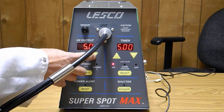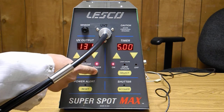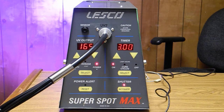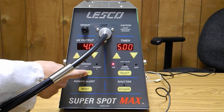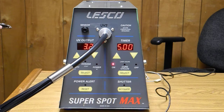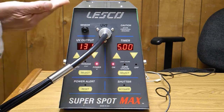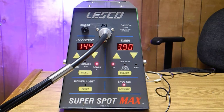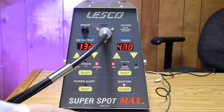We'll drop it one notch to four watts and go back to the power mode — there you go, 160. Very mid-level. Now we go back to the even lower intensity level, which is the lowest end at 3.2 watts per centimeter square, press the select button, do the power mode again. That should only jump up to about 140 watts — naturally it'll peak up to 203, then the circuit will kick in and regulate it. Peak. Regulate.